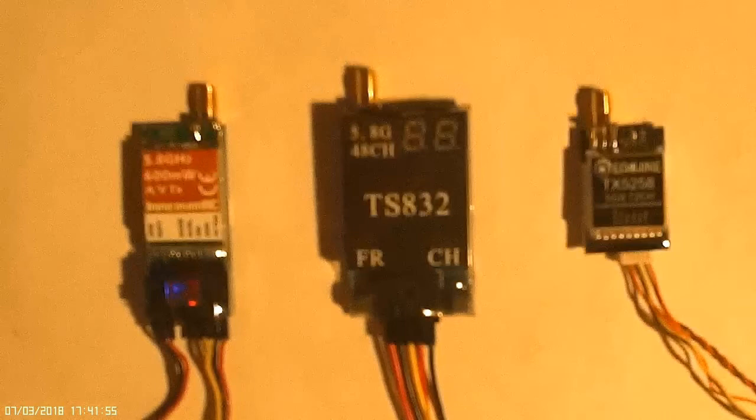I'm very disappointed with the 5258 though. It didn't come anywhere near its rated maximum output power, and the inconsistency in the power it was outputting just wouldn't give me any confidence in putting it in a long range plane. I've bought two of them, so I'll do the test again on the other one at some stage, but I wouldn't be recommending it at this point.